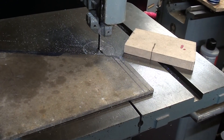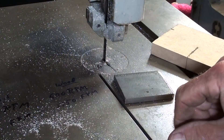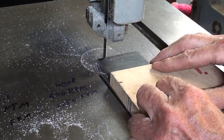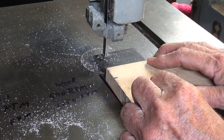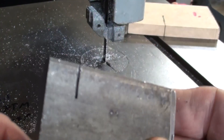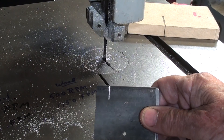But most of my work is steel at this speed. This is 1-1/4 inch thick steel, and again the blade is quite dull, but it will do the job, and that's about the speed you need for steel — 105 feet per minute. Now that isn't fast, but it wasn't bad for a dull blade. The point here is that if you run your cutting speed too fast with steel, you're going to destroy the blade in very, very short order.